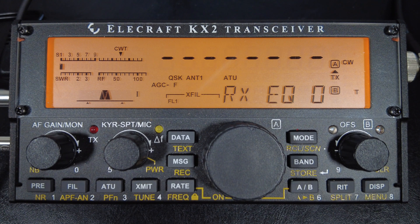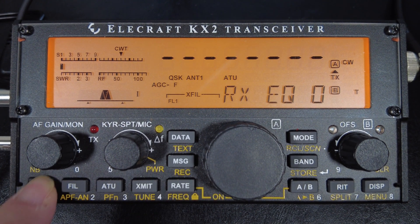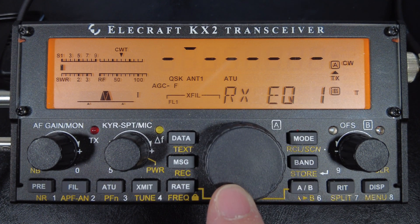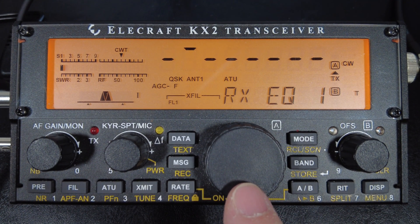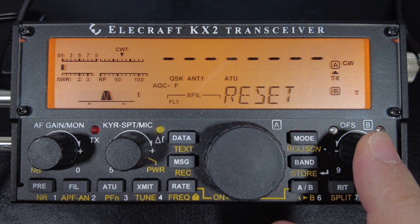To change one of these bands, tap the corresponding number on the built-in keypad — each knob and button has a number associated with it. For instance, to change the second column, press number one. That column will blink and you can rotate the VFO knob to boost or cut that frequency band by a total of 16 dB. Importantly, if you adjust a frequency outside your passband, you won't hear a difference. To reset all bands to 0 dB neutral, press and hold the VFO B knob.